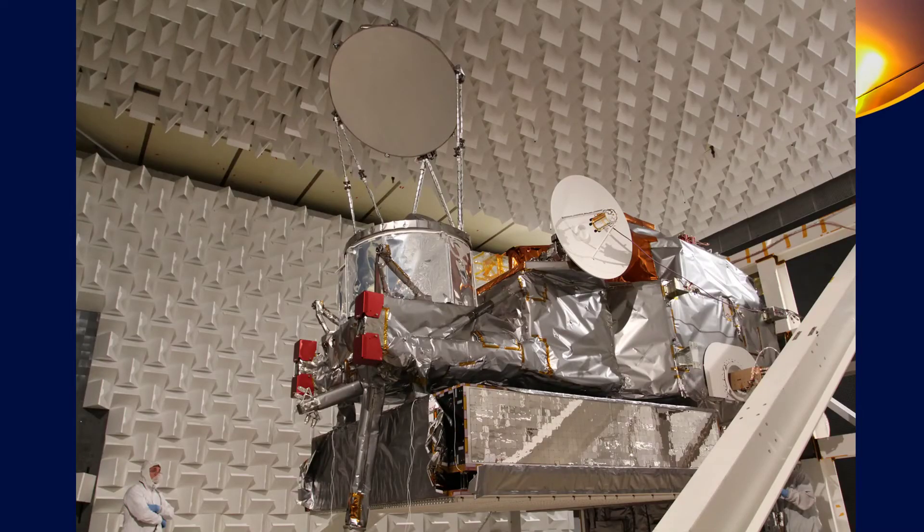The last kind of testing you do is EMI testing. This is a special environment — a big metal box that blocks out all of the radio frequencies from the outside. In there, you can test to make sure that the spacecraft isn't receiving noise from itself, so you can make sure these sensitive receivers are working exactly as you intend them to. Maybe you'll find that some connectors are leaking out a little bit of RF energy that you can cover them or use some other means to help protect your sensitive receivers.